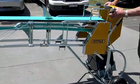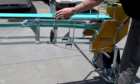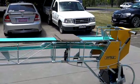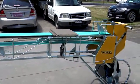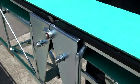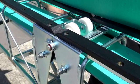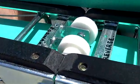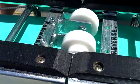To use the elevator in reverse, position the reversing switch on the base before switching to reverse mode. If the bend has been adjusted, it will be necessary to change the direction of the small pulleys under the belt at the bend to ensure the belt does not wander when in reverse mode. If the bend is straight, this procedure is not necessary.